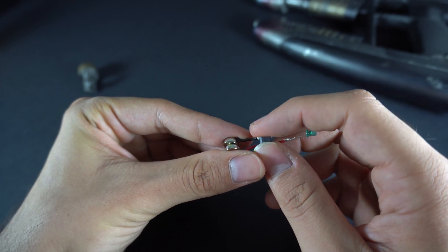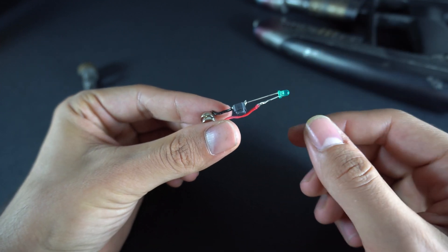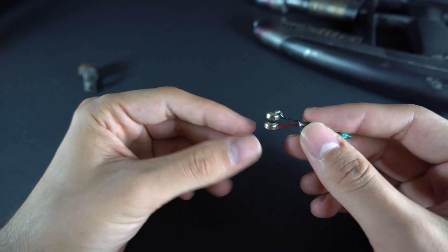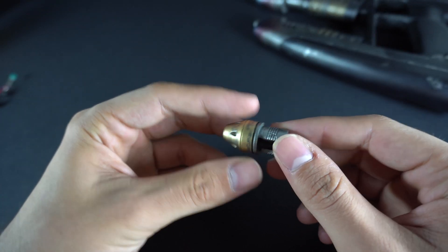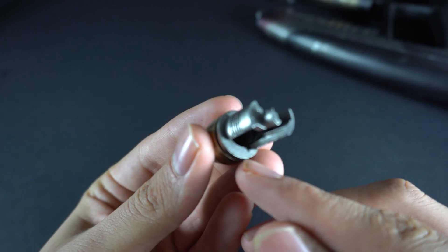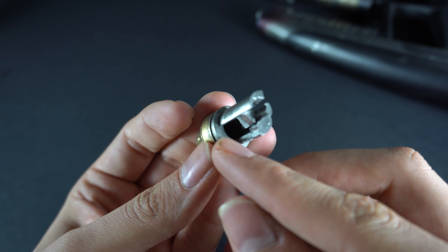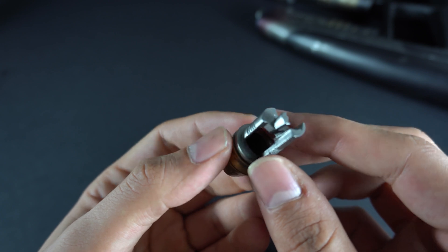When they are against each other they make the connection, and when you press the button it turns the LED on. If you let go it turns it off. This was my problem — I needed a mechanism to turn this into an on/off button. I just needed to make sure the batteries were held together in place. For this I made a piece with little slits for the batteries to go down and stay in position.